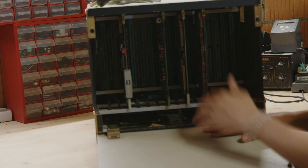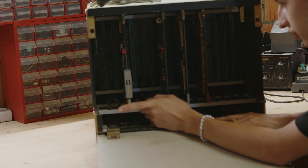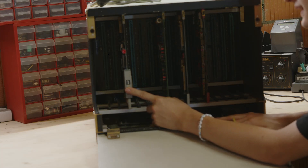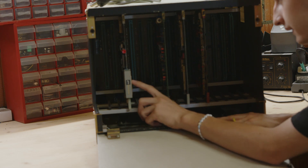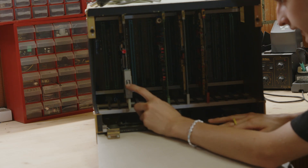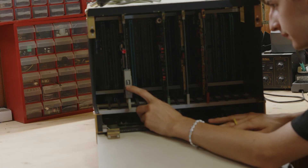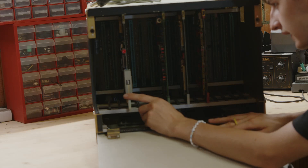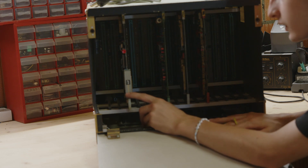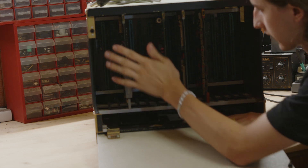I've repositioned the camera so you can see inside. What we have here is a CPU board with a debugging card on it, and that's actually everything I know about this system. There's a little sticker and it says everything is inverted, so if the lamp is on that means it's fine. Then you have the address selector for some address, and then you have RAM CPU error, RAM error, CPU error, signature module, module disabled, signal disabled, watchdog, and two empty ones. The watchdog probably blinks when you turn it on.